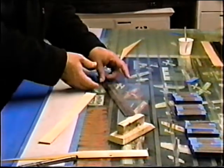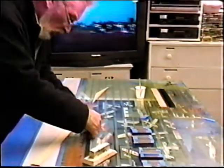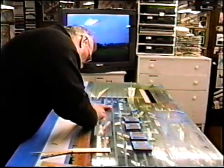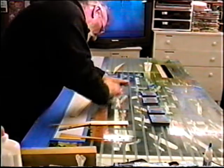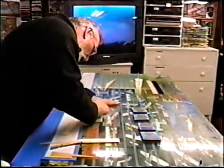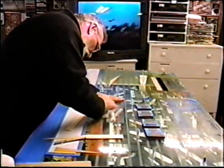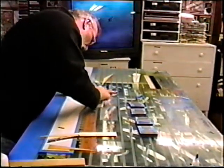What they really should do when they make this material is put peel ply there, so you would get that glue surface. When this stuff comes from George, it's really shiny. You really get a minimum of a glue bond. Well, what you're getting is the cure side. Believe me, that joint would not be as strong as it would be.